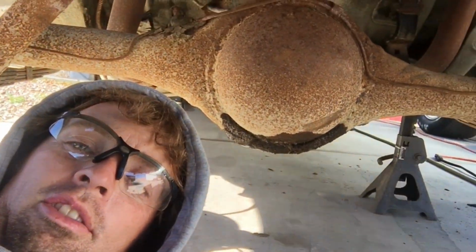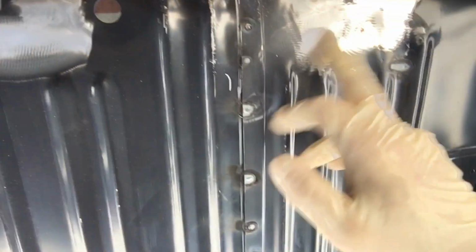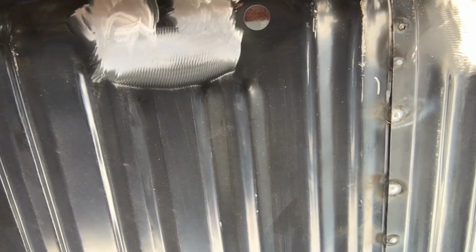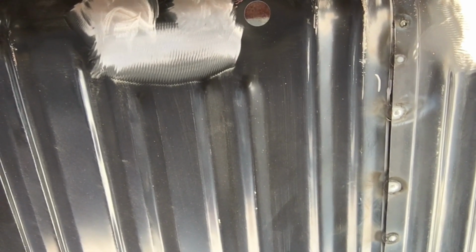Well, under the car now to do the last final part. The gas tank supports, or the gas tank strap supports. As you can see, that brazed area right there kind of pisses me off, but whatever. It is what it is. Just need to spray these with copper and weld them on there, and this is done. The only things left are caulking and paint. So, yeah, finally. And then I'll show you the inside here in just a second.